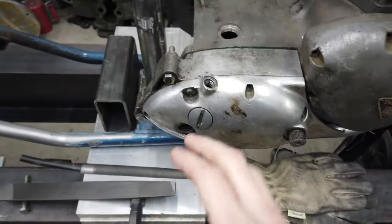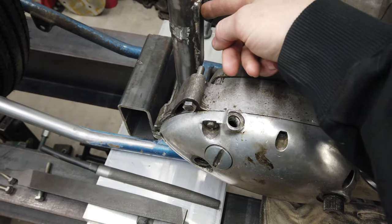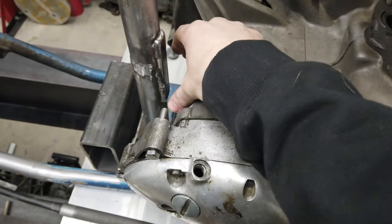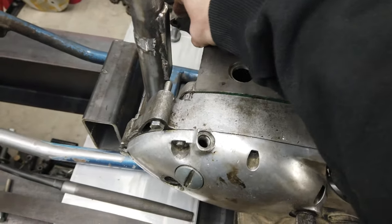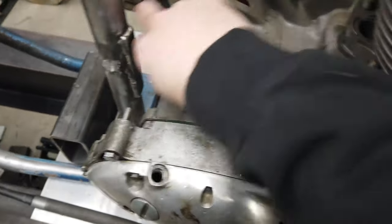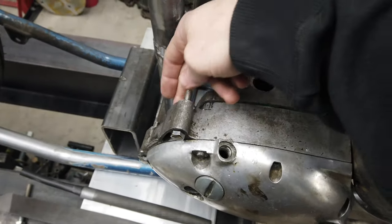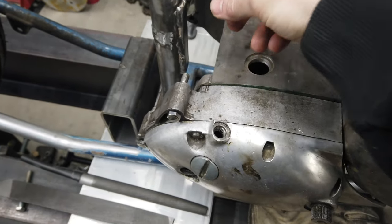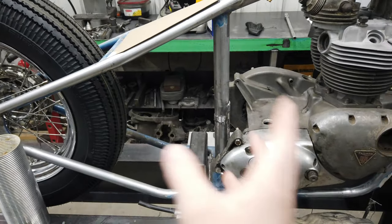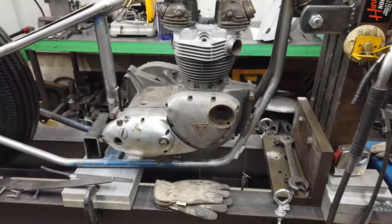What I'm going to do is I want to make something. It's got this tab brace already in here, which I don't know if I'll gouge that out and start over or not. But what I'm thinking is if I make a bolt-on rear engine mount that will snake in on the back side, and then I'll make like a sub bracket here even, that will then use those two mounts and these two mounts. Normally the plate would go through those. I just want it to all kind of web back behind here, and then I'll make it so it slips down in and bolts in. That way, when you look at it, it just ends there. There's not all this garbage kind of hanging off the back. And so I'm hoping it'll keep that suspension look of the engine that we have right now.